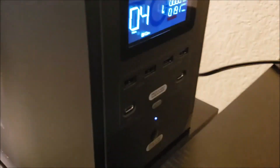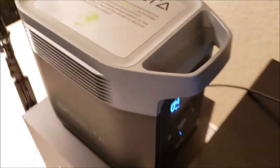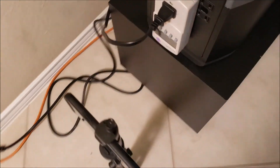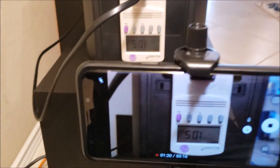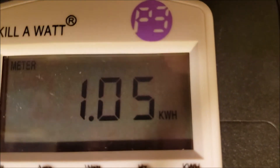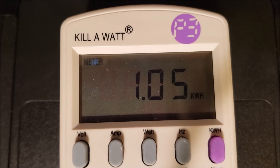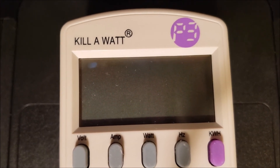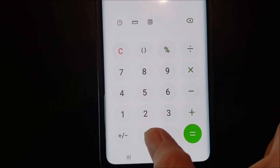It's been seven and a half hours — four to five minutes left, one percent state of charge. This is my setup with my camera filming. Now it's at zero percent state of charge. The kilowatt meter reads 1.05 kilowatt hours, which times a thousand is 1,050 watt hours. It just shut off. So now I know my Delta 1300 will provide me 1,050 watt hours to use.